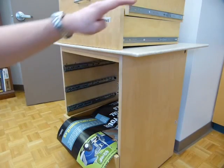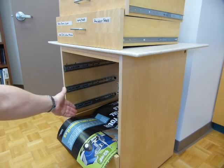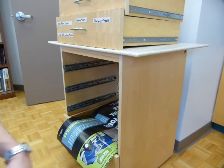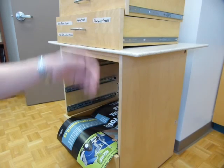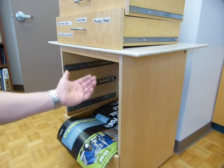I want to install this countertop on top of this base cabinet here. In this video I'll show you how it's done. Pretty straightforward. I've removed some of the drawers from the unit and I put them on top of the counter so they weigh it down and help me with the installation, because I'm going to be placing screws into the countertop from the underside and I need some extra weight. It's good for that, so when you put the screw in it, it doesn't uplift.